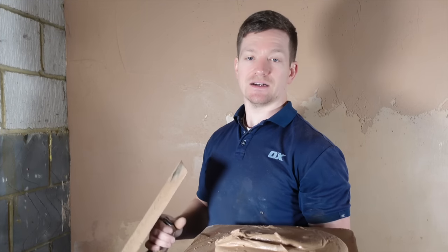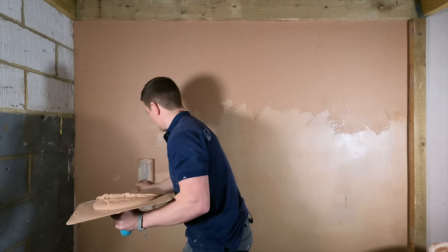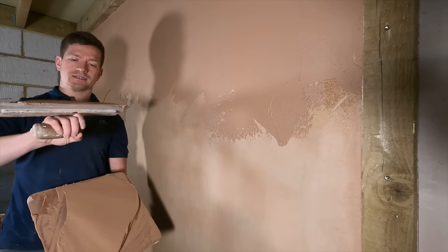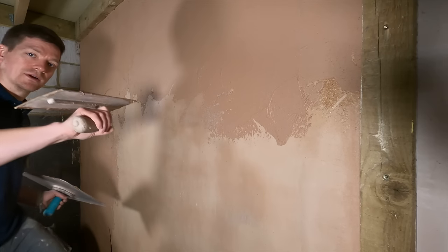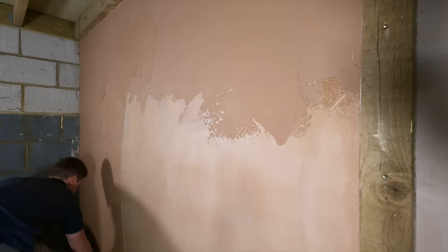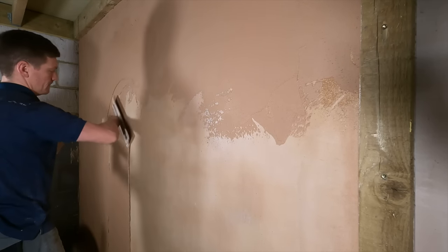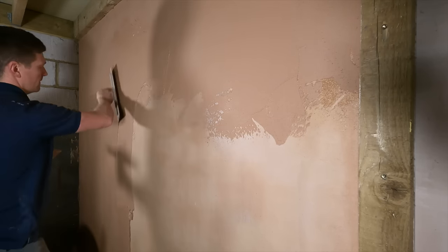Just take a little bit of time. The top and left side of the wall is on. Now we're going to come to the bottom. This is the main way to apply plaster — it's going to be the longest stride. Take the plaster, bring it to the bottom, all the way up. Take the plaster from the hawk, come to the bottom, come up, then come back on yourself. What we're doing is trying to trowel out the lines we left behind — come up, come back on yourself.